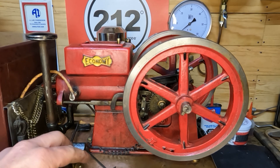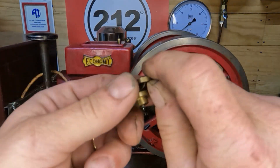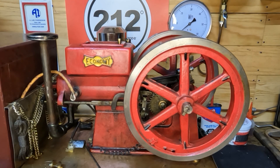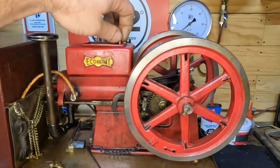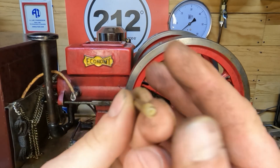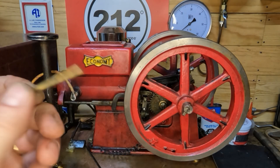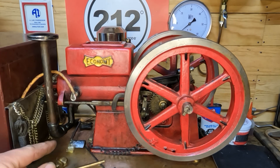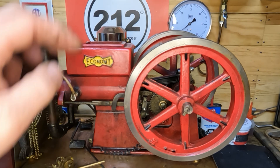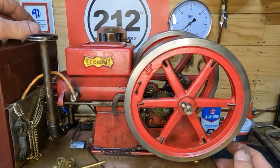So what's next? We've got our axle fixed, we've got our crank shaft fixed. I don't know if I showed you guys this or not, but here's the remains of what was the oiler that was on top of it. The brass is still good but the glass is broke - not a big deal. I looked at replacing the oiler but when I took it off I found that oiler does nothing anyway - it's just decorative. We can fix that one, put a new screw in there and cut a piece of glass to fit. I'm actually thinking about drilling the cylinder and putting a functioning lubricator on it.